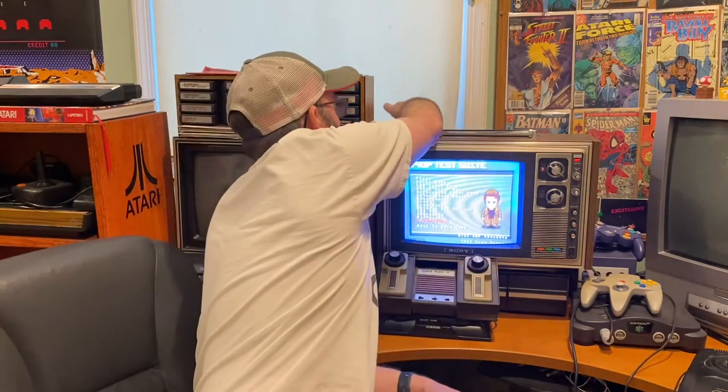I'll open it up again, put my special plug on there, and fire it up. There's also that sound I've got to fix — something's loose in there. I'm going to open the TV up, take the yoke, and physically twist it. It looks kind of tilted, so I can fix the screen tilt that way, and pulling it in and out might help correct some of the other issues. I'll also be adjusting some potentiometers to get this looking a lot better.